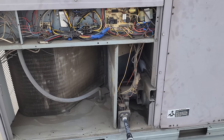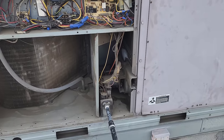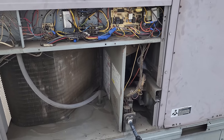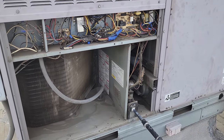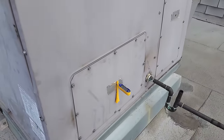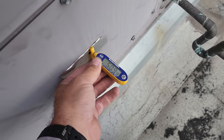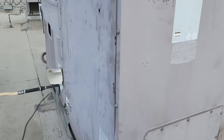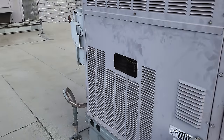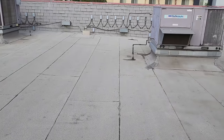We're going to put this one together and move on to the next one. I'm looking for obvious things — once I get those fixed, I could dive further. I also have someone working on another unit on the building, so we're tag-teaming these ACs. This next one is also running. I just put my thermometer in it and we've already got a 50-degree supply air temperature, still dropping. It's about 70 degrees in the building, so no problem here. That takes care of their bar.